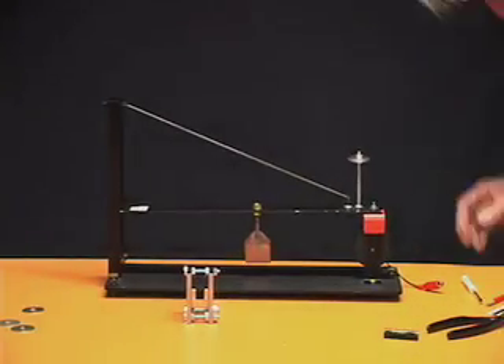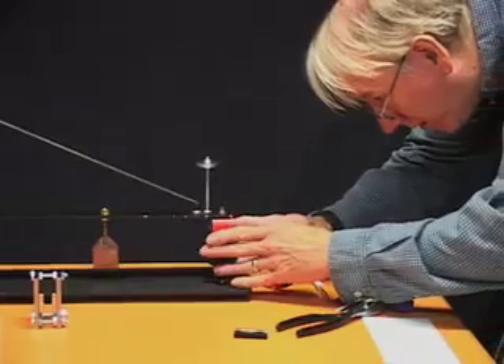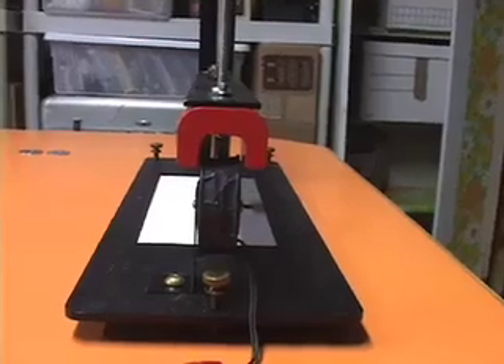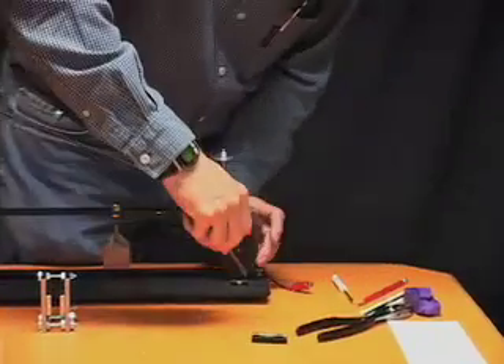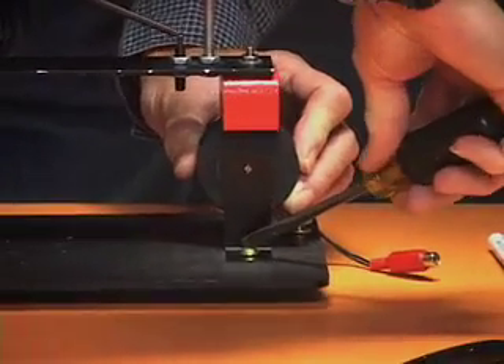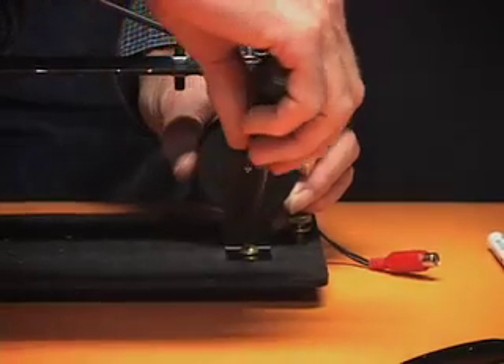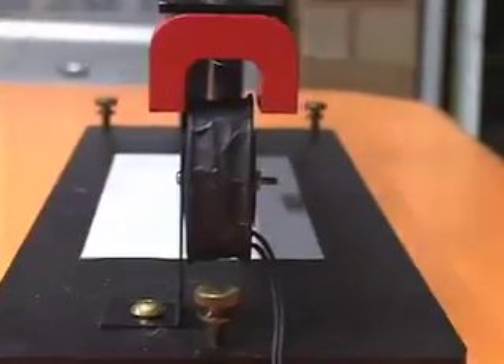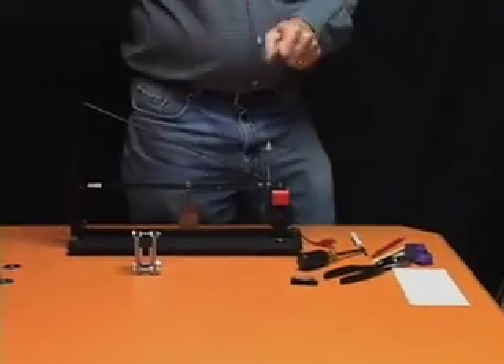The next thing we do is adjust the position of this coil. You can make some adjustment by loosening this screw. There's a little bit of room — the hole of the slot in the base is a little bit larger than the screw, so you can make some adjustment there. I'm pretty close. You really have to look right down the end to make sure you can see light on both sides of that coil. The magnet actually spans the coil. There has to be light on both sides — an air gap — so there's no friction.